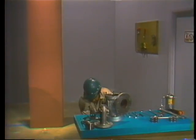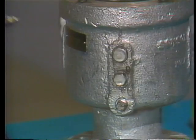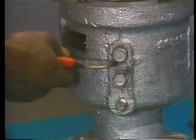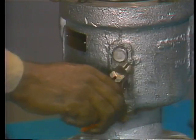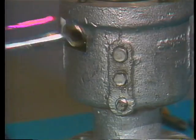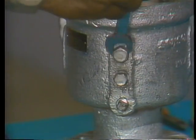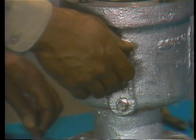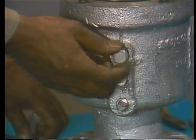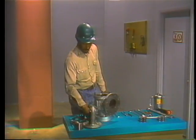As the mechanic's notes show, the distance between the top of the upper ring and the lip of the valve body is five-eighths of an inch. After recording this first measurement, remove the upper adjusting ring. This is done by first cutting and removing the locking wire that holds the upper ring and lower ring locking pins in place. The upper locking pin is then broken free and removed from the valve body, freeing the upper adjusting ring, which is removed by simply unscrewing it until it comes free.